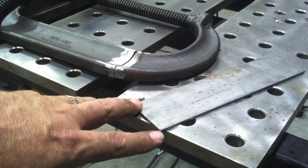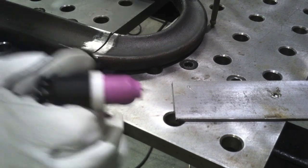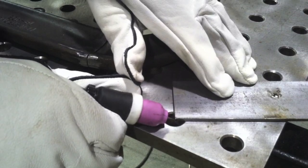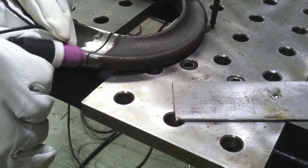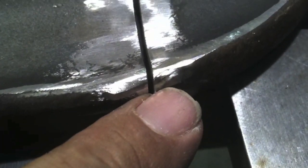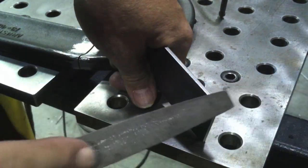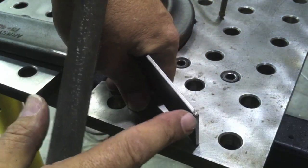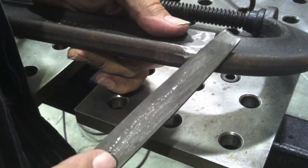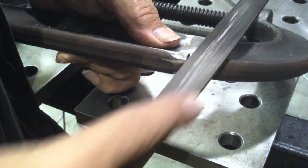I got it all cleaned up, and I'm going to let you in on a little trick that's really helped me identify metal and know what I'm going to be up against. I'm going to take the TIG torch and very quickly puddle a little corner. I know this piece is mild steel — just 1020 steel — but I don't know what the clamp is, so I'll puddle it quickly and then try to cut it with a file. If it has enough carbon, or a combination of carbon, chromium, vanadium, and so on, it'll harden. If it doesn't harden, I know I'm home free; if it does, I know I'm up against something more difficult — more likely to crack or get brittle. Both of these little areas I puddled are filing very easily, so I know for a fact they just can't have much carbon in them.